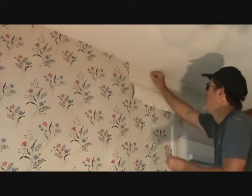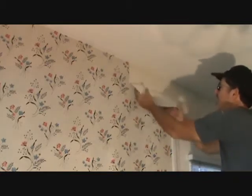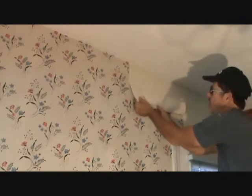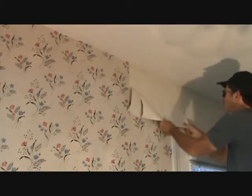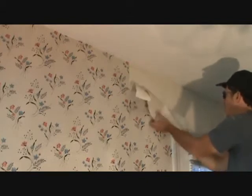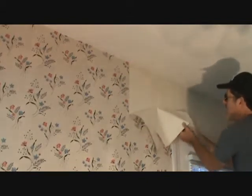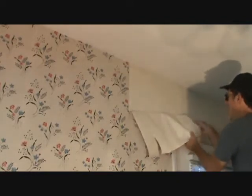See there — that was it. If you can't get it now and you've got two pieces ripped, what you want to do is rip them back down together so you can try to get the paper all in one go. That way it's going to come off. You can pull it at an angle so you don't have as much on the surface at any one point where you're pulling.